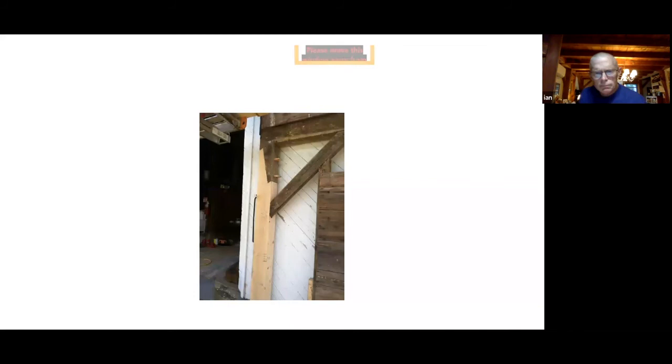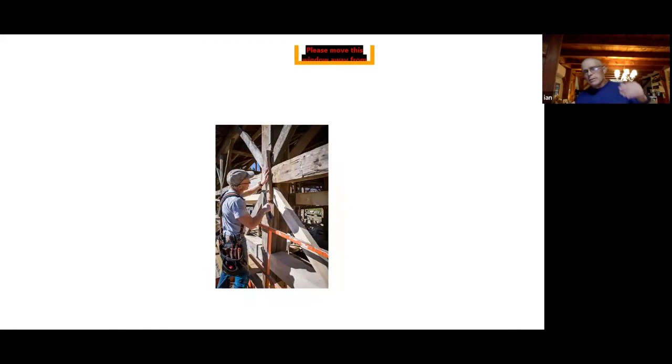Here's an example of that long locking lap joint high up on a queen post, where I've reconnected it to the knee brace, pegged it, and the post retains most of the integrity of the original. This next slide shows where joinery has pulled out on that really nice timber frame. We got it back together again, but the shoulder of the mortise had broken out due to movement. Rather than replacing the whole post — which is in good shape — we cut out a segment and glue in with epoxy a new piece over it, which maintains the integrity of the side walls of the mortise.